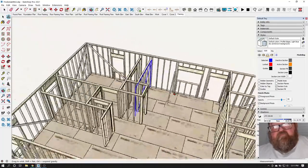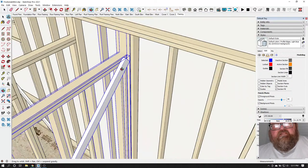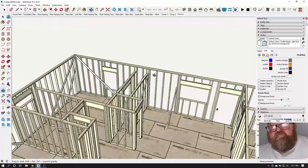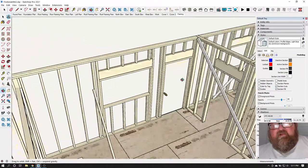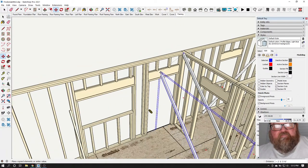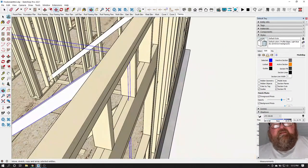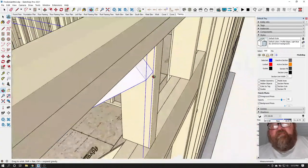You want braces about every eight feet. In real life I'd probably nail a little block there and raise that brace up, because what I'm going to do with these intermediate braces is straighten the wall. This temporary brace right here — while we're only nailing the tops right now so they'll stay up — I would come over to the middle of this wall, around the middle of this window, and nail the brace on the side of that cripple. I would not let it stick out past the plane of the wall, because then I'd be mad when I go to put my sheeting on.